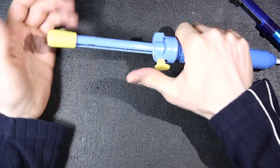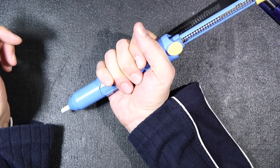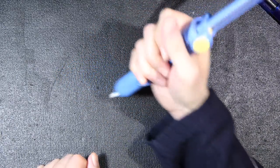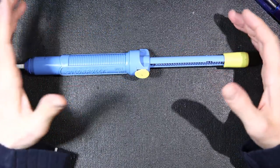One of the things I find myself doing — and a lot of people do as well — is in order to charge the large one, you hold it in your hand, turn it around, and press it against your hip to push it in, then use it back and forth. You'll find yourself doing that a lot, especially if you're holding a circuit board or you've got an iron in one hand. So it really depends on your application. With the large tool you get quite a bit more suction, and I find that these things last quite a bit longer.